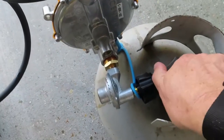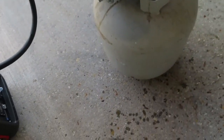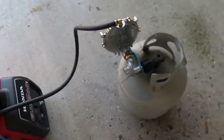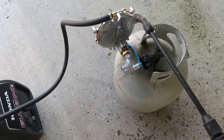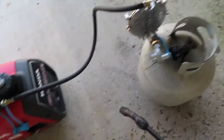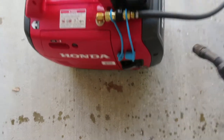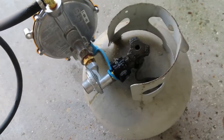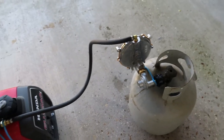We're going to turn on some propane. Before cranking this thing up, I'm going to look for some leaks — this is soapy water. If you've got leaks, it makes big bubbles. All right, no big bubbles — that is a very good thing. So let's try the crank.